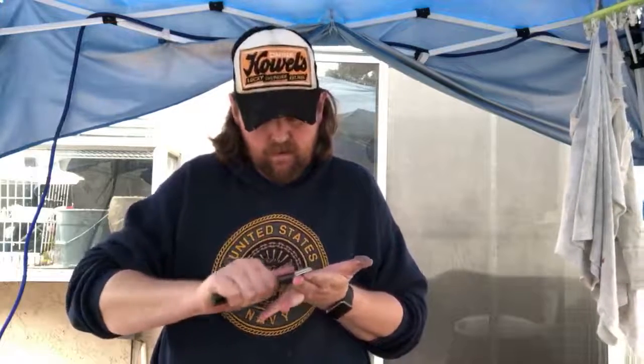So like I said, when you're dealing with sharpening, it's a matter of patience. You cannot use more pressure. It doesn't get you anywhere. Using more pressure just wears your stones out. This is an exercise in patience. Straight razors even more so. Because it's so flexible, when you get to grinding your bevels, it would just move. It would be like trying to grind Play-Doh. The thinner it gets, the more flexible and malleable it gets.